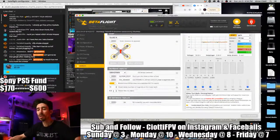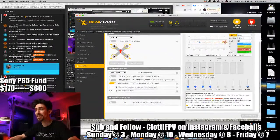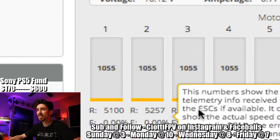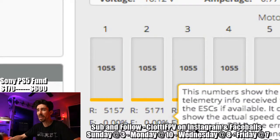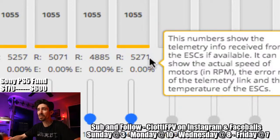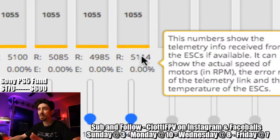I understand the risks. Motor idle is 5.5%. So that means that we're gonna spin these motors up to 1055, right here. 1055 is the same thing as 5%. And what we're gonna look at is these RPMs: 5100, 5000, 5200, 5100, 5000, 4900, 5000, 5100, and then the last one, 5200, 5300, 5000. We're just trying to get a range. So the rough middle is 5,100 because these things are bouncing between 4,900 and 5,300. So right in the middle is 5,100.